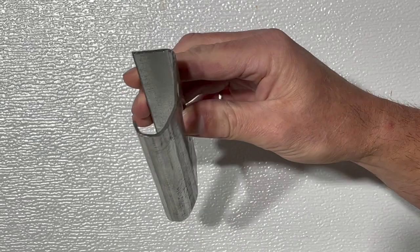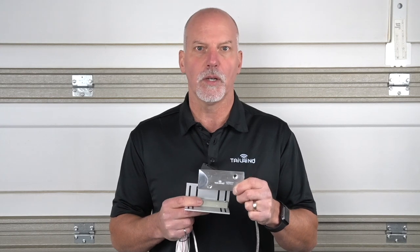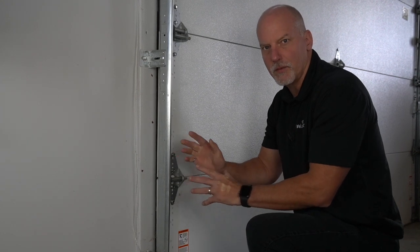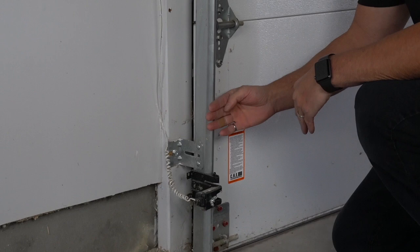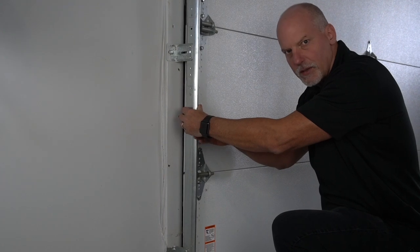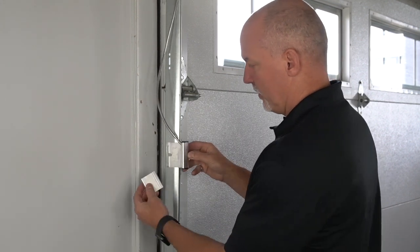Here's a close up of what standard garage door J-Track looks like — it gets its name because the profile looks like the letter J. The other version of the IQ3 Pro comes with a universal commercial grade sensor, making it perfect for gates or doors that don't have a J-Track, or even doors that do have a J-Track but may have a lifting bracket that slides up the rail and would collide with the other sensor. If you ordered the IQ3 Pro for standard sectional garage doors, check the door to see if there's any part mounted to the door that rides up along the J-Track and would collide with the sensor. If there is, you need the universal sensor. So now install the J-Track sensor to the J-Track.